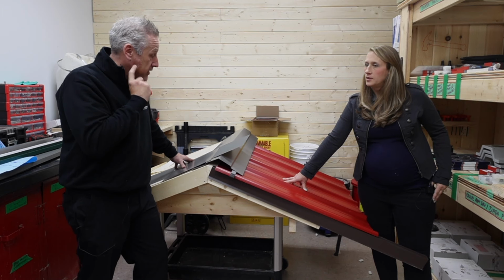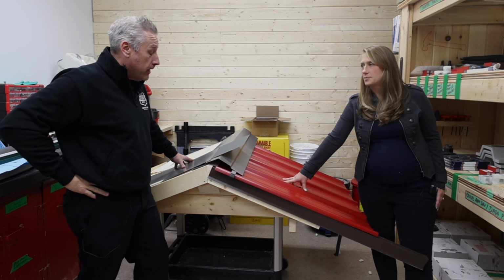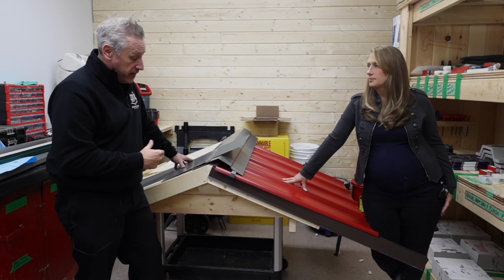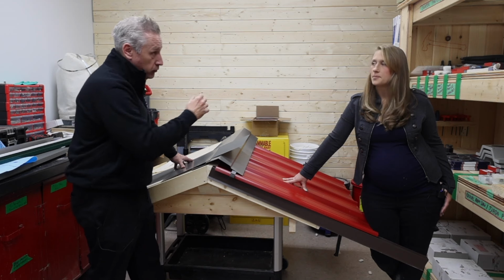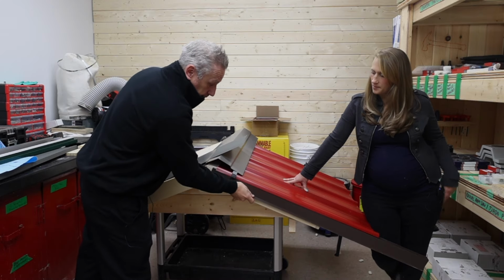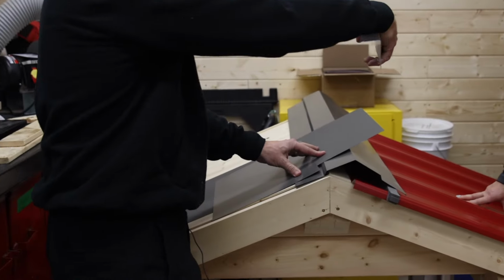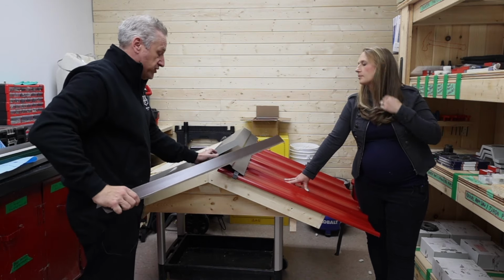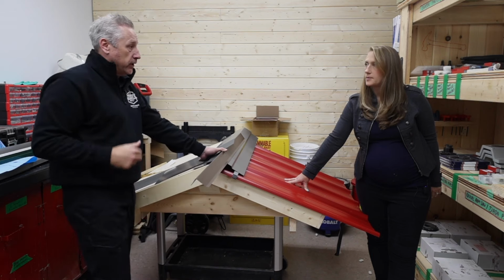Other than that, I don't know what else I'm asked that isn't already covered in the questionnaire here. Some of the models, like the Rockwood specifically, are a bit different. It's a split roof, so some of the materials are different, and there's no ridge cap. What they do have is a ridge cap with two different versions. We have what's called an end wall flash, which looks flat and then has a straight vertical piece that goes in the lower piece up against the windows. And the very top looks very much like our gable starter, this one here. But it actually has a little front face and a much bigger, taller face, and it goes over top of the steel. So it sits in the front and then goes up over the sheets like half of a cap, which we call a cap flash. So very similar. Again, the premise is exactly the same: you always want to clad your roof from the bottom up. Those pieces are the same, it's just the tops that look a little different.